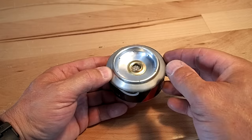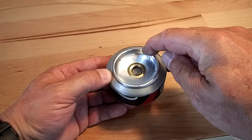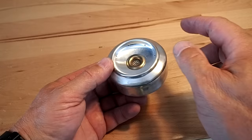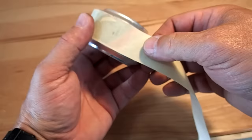I've experimented with many hole configurations on the top. Here, seven holes on the inside with seven holes on the outside — the outside holes are a smaller diameter. It burned fine, but the flames were too short for my liking. I've found the optimum configuration is simply to put seven or eight holes on the inside, drilled at an angle so that it creates a whirling vortex as it burns upward.